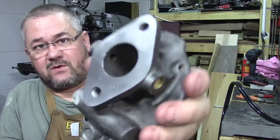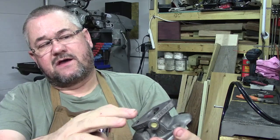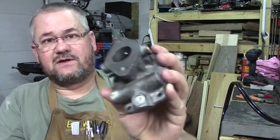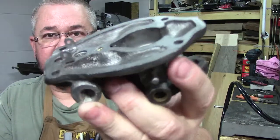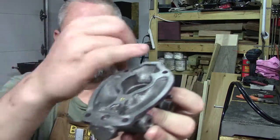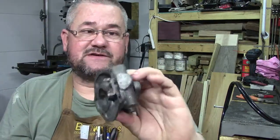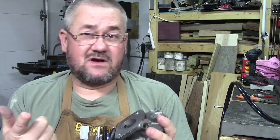Now, I did some basic lapping in, okay, got that to where it's nice and smooth, and we can still see the wetness, and we've got a real nice smooth surface there. Don't know if it'll show up on camera, but that's really good. We went in here and just very, very lightly touched up with 600 grit sandpaper, just so we had a nice smooth contact surface. Typically what happens is this here, someone used some steel putty to make a repair, which is common.